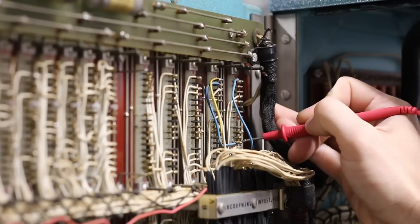But those signals have to actually make it out of the machine to the typewriter. The type signal should be on pin 33 of PLF1 — the big cannon connector on the back. Craning our head inside: pin 33 is blank. The type signal exists within the machine but never makes it out the back. So I think we have a numeric machine that has alphanumeric signals inside it — possibly the other flip-flop on that board is being used for some other purpose within the machine that I'm just not seeing yet.